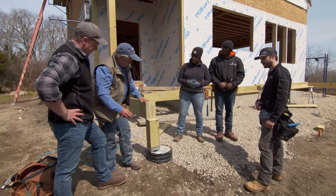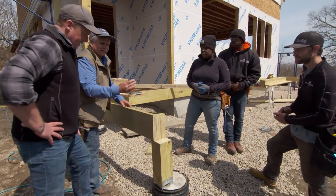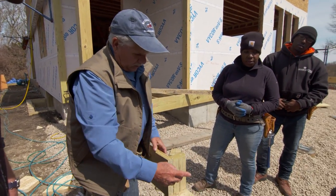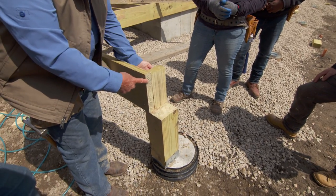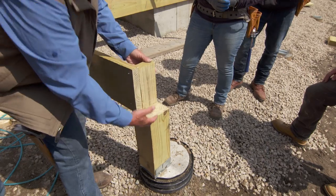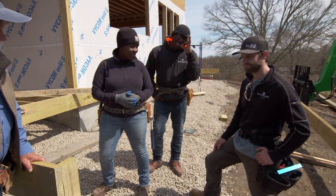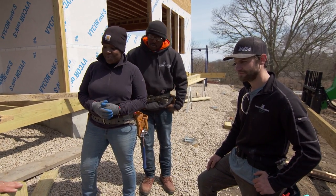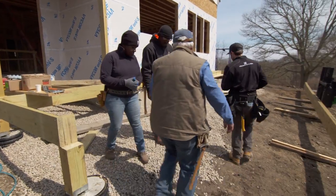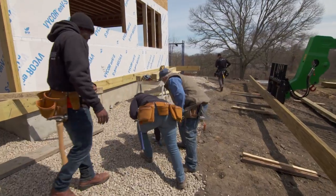The plan first: we've got a guideline right here. This joist has been cut 67 inches — that's the inside dimension of our carrying beam right over there. This is a notch for a beam to set on; we'll screw it from behind, and that's our way of making a mechanical fastening system so that it doesn't lift. Ryan, let's get a measurement out there so we can get a line down. Make sure there's no stone in the way when we snap this line because we want to set our outside position on all of these.